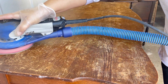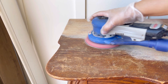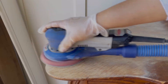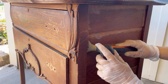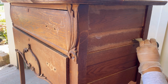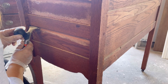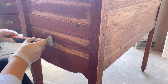This beautiful buffet table has a lot of wood grain texture and the grain was deep. As I started sanding with 120 grit, some of the dark finish was left behind, so I switched to an 80 grit which is coarser and will go deeper into the wood. Afterwards I'll come back with 120 grit to smooth any marks left by the rougher abrasive. There are a lot of 90-degree angles here so I'm removing the finish with a carbide scraper which fits perfectly. Just a quick reminder: when you use the scraper against the direction of the wood grain, be very mindful and careful — don't put too much pressure because it will damage the wood.